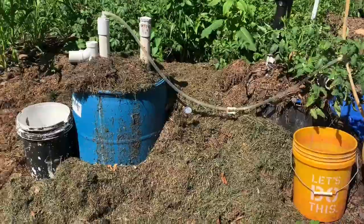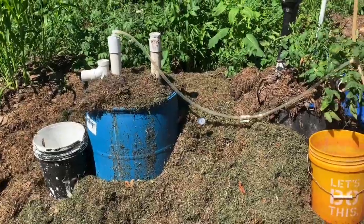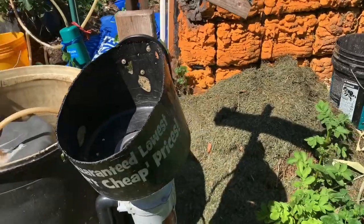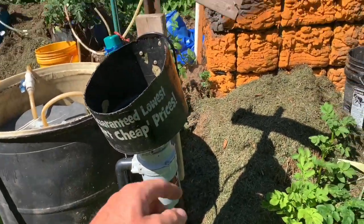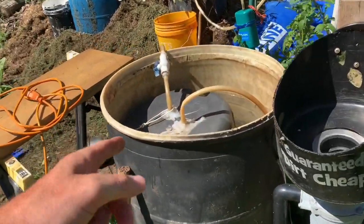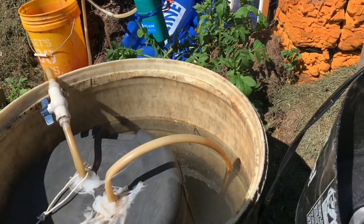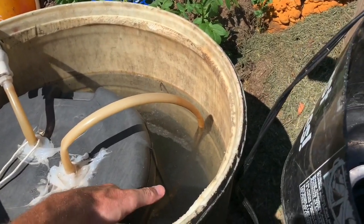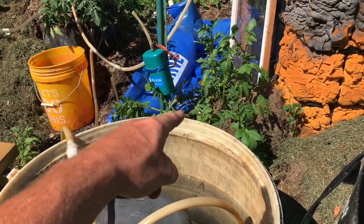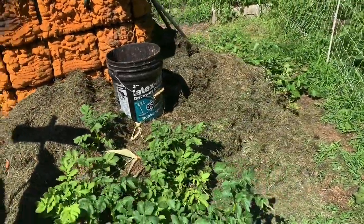I've got tons of videos up now about the biogas and how you build them — check it out. Comment below if you want and I'll do what I can to help. So again, this is an InSinkErator to grind up food waste that goes into the digester. I use a generator, that's a secondary gas chamber, and this is a water trap. When it's full — this is all free stuff — it's an upside-down trash can inside a 55-gallon tank. Once that blue bag gets full, it pressurizes and lifts right up.